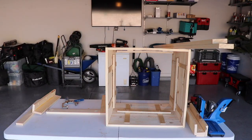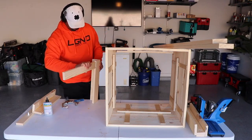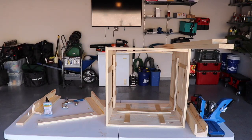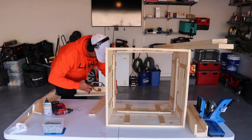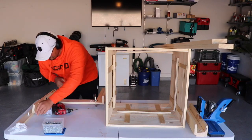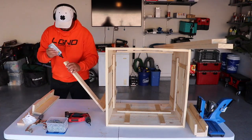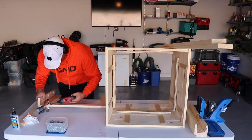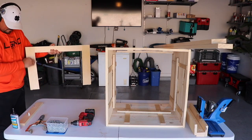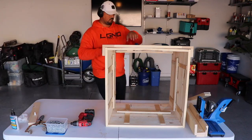As I said before, this wood will move a little bit, so I'm actually building the frame and the inner box to be independent of each other. Number one, it was easier to finish that way. Number two, should the wood move, I can essentially rebuild the box inside the frame should we not like it — I could secure the panels directly to the frame rather than having a separate box that slides into the frame.